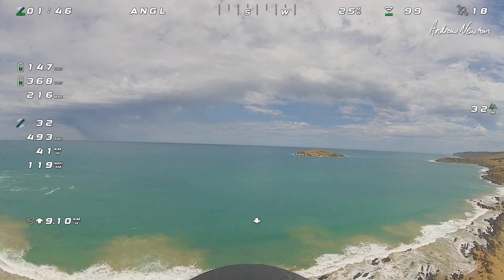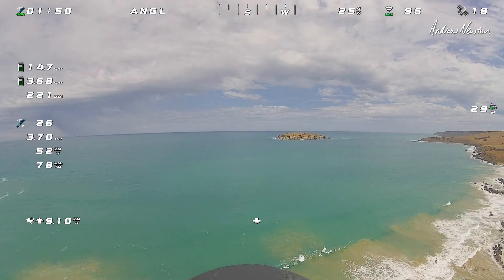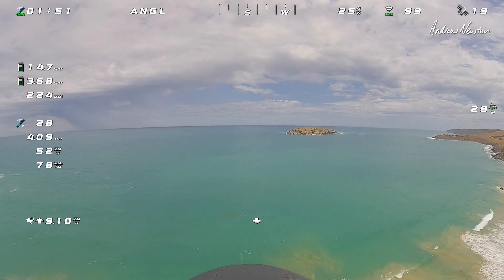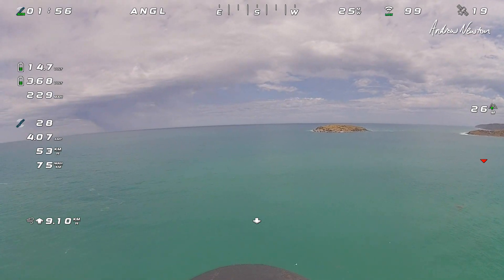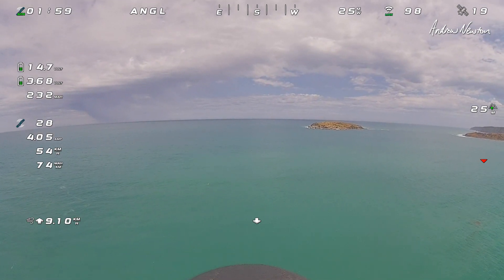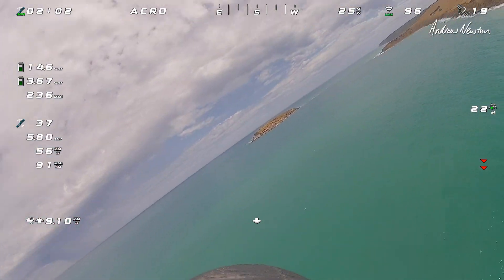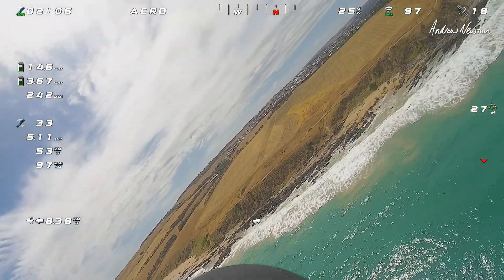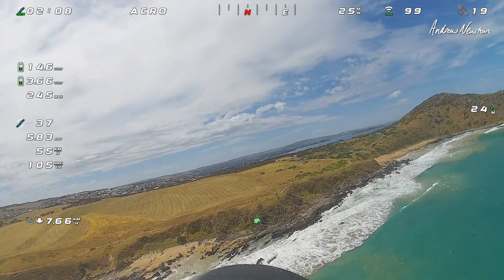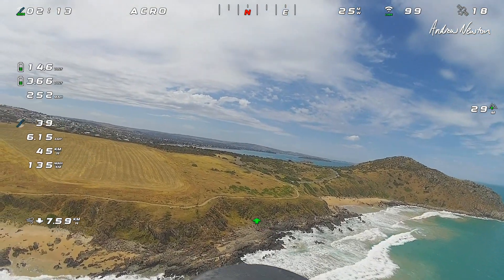Let's try angle mode again — I think it is descending a little bit. At 28-27 degrees, yeah it is a little bit. So I'll lift the pitch board trim angle a little bit, reduce the cruise throttle, and increase the elevator feed forward. Alright, that's quick and easy — let's attend to those using the app and fly again.